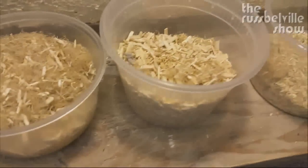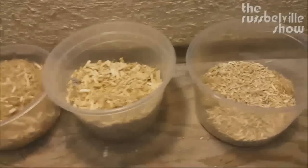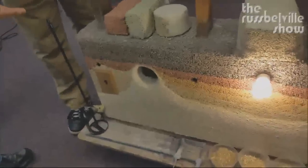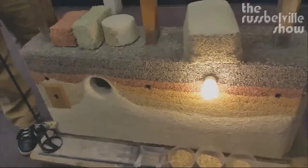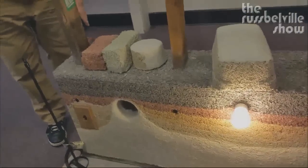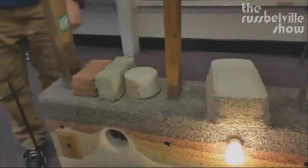Say this is your footing and you're going to do standard floor joists and you're going to have a crawl space. You're going to have to put something underneath it or you're going to have to use a bat to insulate there. And then out here, if you wanted to do lap siding, you could just stick frame, or fur it out.